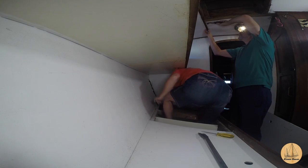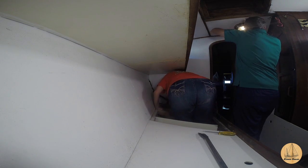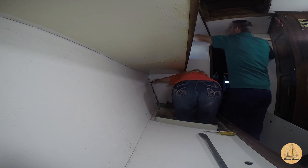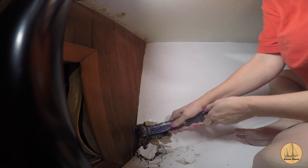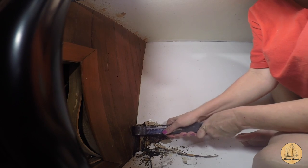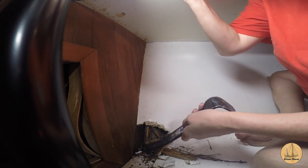This isn't exactly the most graceful looking scene, but we pulled the top of the bunks out so Deb can get down inside. She's got a small pry bar and she's basically breaking out the edge of the wood to get the pry bar underneath and starting to pull some of it up. Moving to the other side along the back of the chain locker, you can see where this had leaked — the trim wood that holds up the outer plywood skin is just completely rotted.